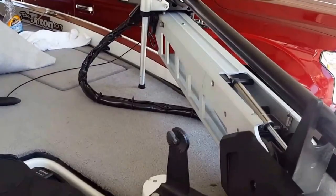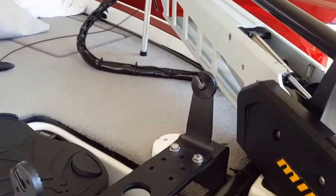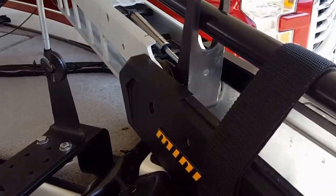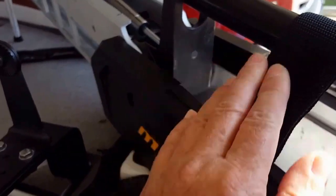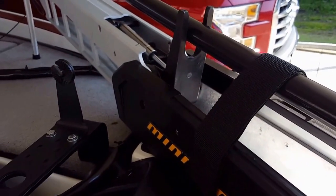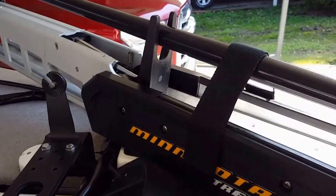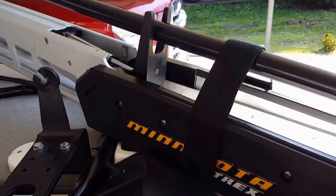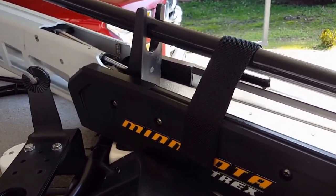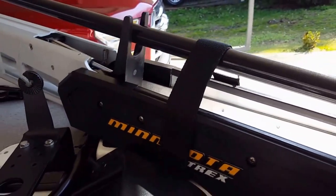And there's your shock buster on there, your bounce buster. There's your cabling layout, how I've wired the transducer on it. Here's your strap that keeps it from basically beating to death going down the water. And for those that think you don't want to do it, or if you've forgotten it, I just go to the hardware store, get those stainless steel hex bolts that I'm telling you about, just take it off and reinstall it. You're going to wish you had. You need to put that on there.